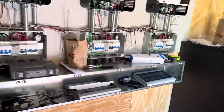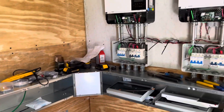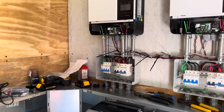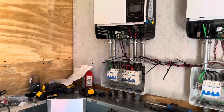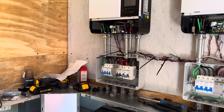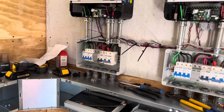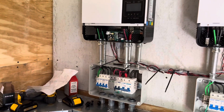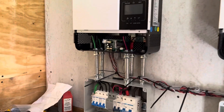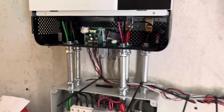This panel will feed the inverters. At night when the PV panels are not generating any power and when the battery bank is depleted, the inverter will take power from the utility and do an output. This inverter is a little funky about how it does it — it's supposed to supply output power with PV input and utility input simultaneously. If you have some PV power available but not enough, the utility is supposed to add to it. But when you don't have PV input, like at night and the battery is dead, this thing runs in bypass mode — and I'm still learning more about that because the documentation on this Growatt is not very good.